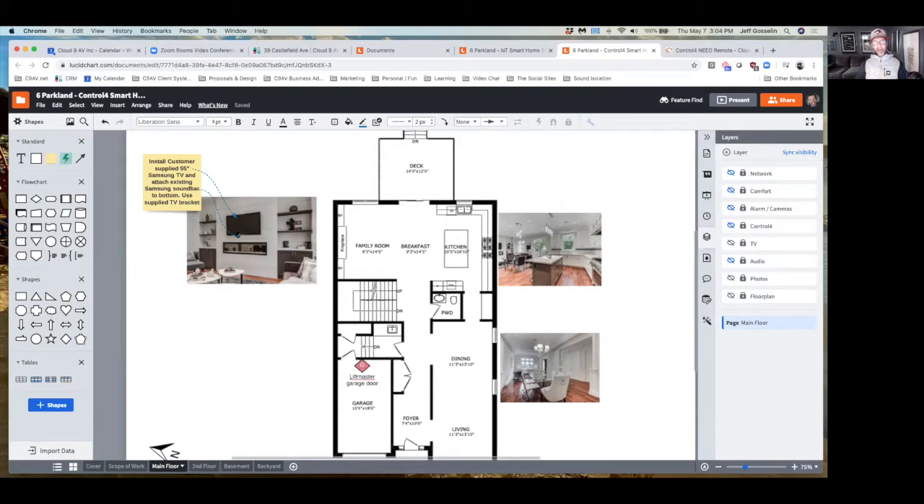If you want other solutions they just cost more. The ceiling speakers unfortunately are not in a good spot — when integrating something with TV it shouldn't be above you, it should be in front. You could do a soundbar or put little bookshelf speakers and hide that Triad 1 amplifier in the cabinets. I know we can get wires across there based on how it's built. I've assumed for now we're just going to mount your soundbar below the TV, but I'd recommend attaching it using an adapter bracket that mounts it along with the TV bracket — that'll future-proof your solution so you don't have to patch any holes.